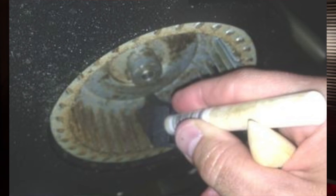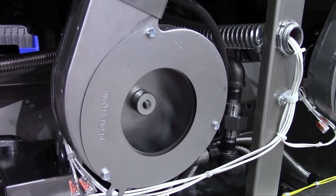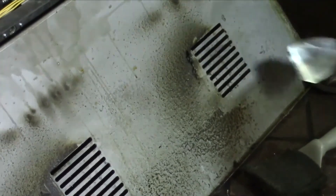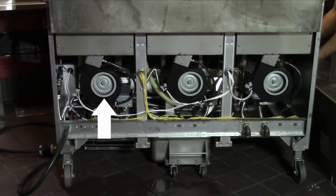These blowers need to produce 0.8 inches water column to close the pressure switch. On the silver backwards-curved blowers, they need to produce 0.4 inches water column. The planned maintenance — which includes cleaning of the rear cover and the blower wheels — keeps airflow slowdown from happening.